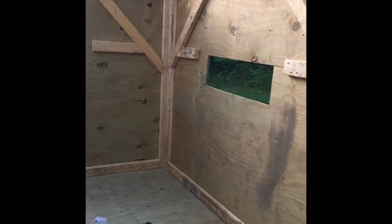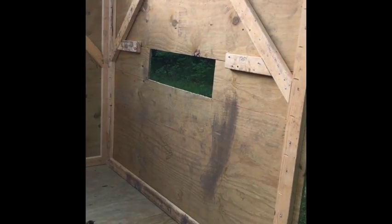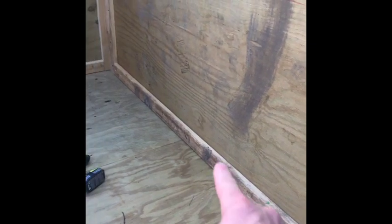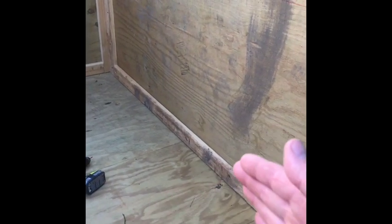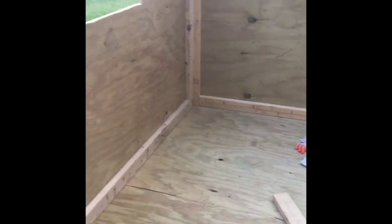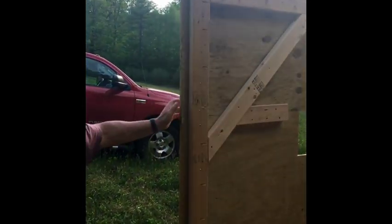Okay, so the third wall is up now, right here, and we secured it again along the vertical joining point. We did not screw in the bottom there yet, because we want some flexibility to make sure it's nice and square with the last wall. We did put our bottom screws in on the second sidewall already, so that's nice and secure. And you can see John let go just so we can see. We don't need the supports anymore, so it should be self-sustaining.